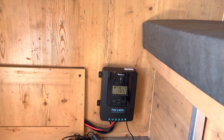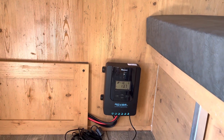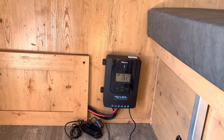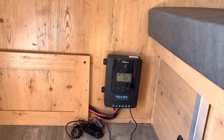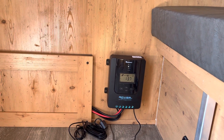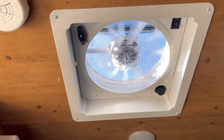Just for safety reasons. The kit did come with a thermostat but I did not hook that up yet — I may be hooking that up later. The thermostat actually goes down to the battery compartment so the charge controller can keep an eye on how hot your battery is.